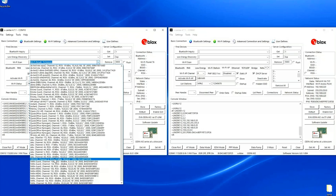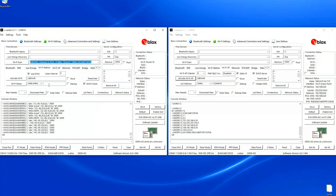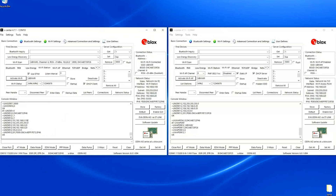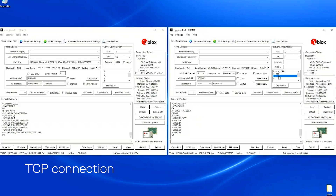You find it, I need to set the password, and I simply activate the Wi-Fi. It will now connect and get the IP address. If I want to send data between them I need a TCP or UDP connection, so I will set up a TCP connection and I need to set up a listener.